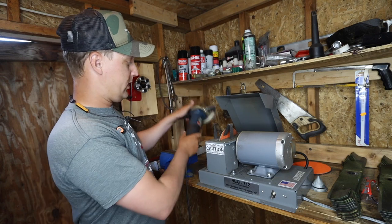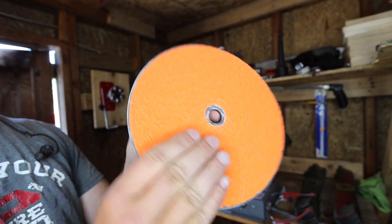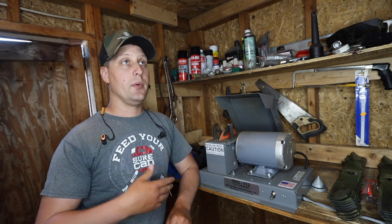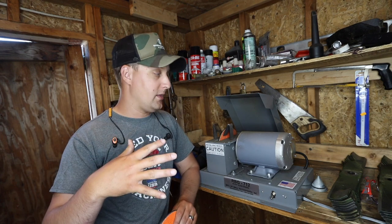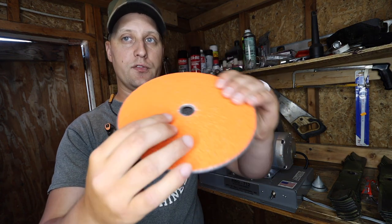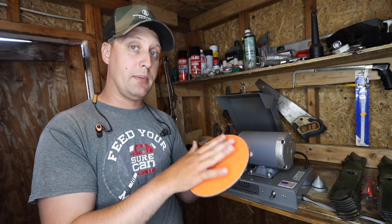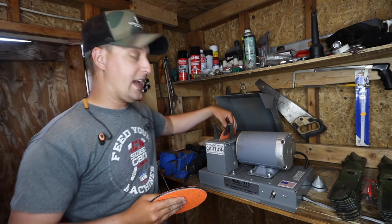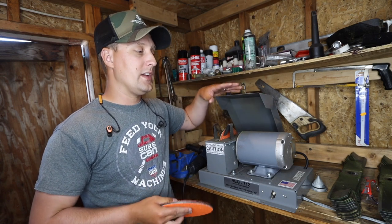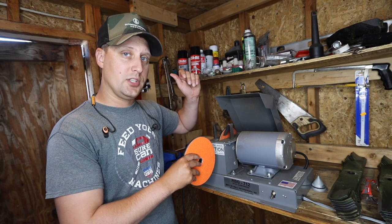I feel like the grass cuts better and the blade life lasts longer. I don't take off as much material as I might with an angle grinder — with this, I take two or three passes with the blade and we're good to go. This orange wheel that comes on your RBG712 when you order one initially — a lot of you ask how long the wheel lasts. About a year. That's sharpening 10, 15, 20 blades every two weeks when you mow 100 lawns. So basically, a wheel a year, and this wheel is about $60. I've got maybe three or four weeks left on mine, and I'll probably do a follow-up video on how to change out the RBG712 wheel.